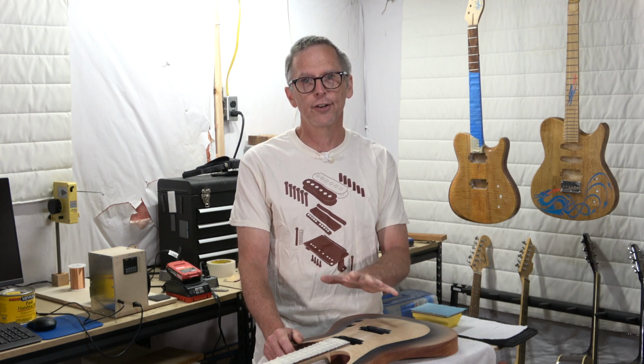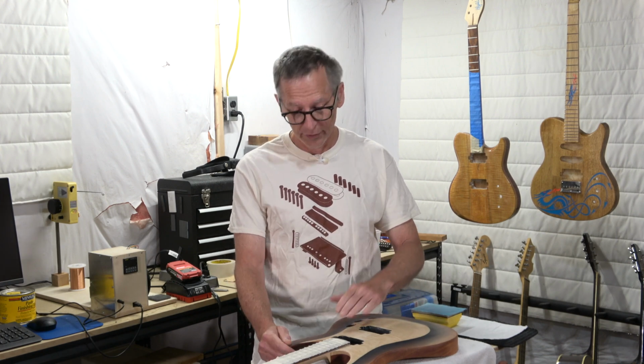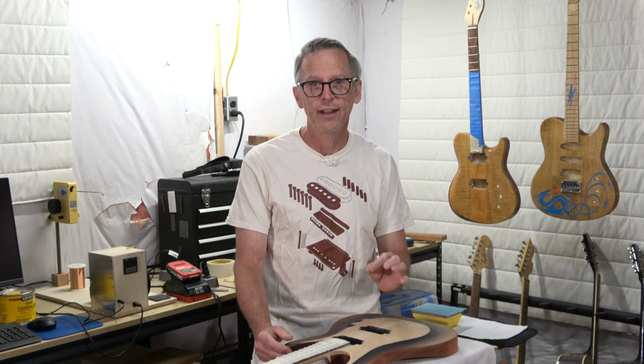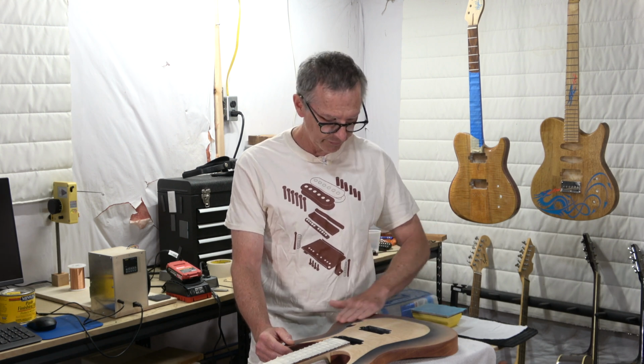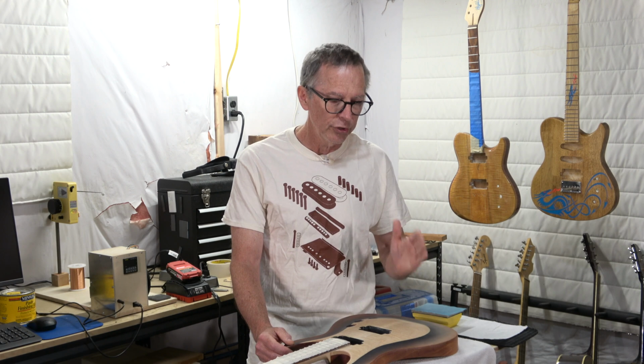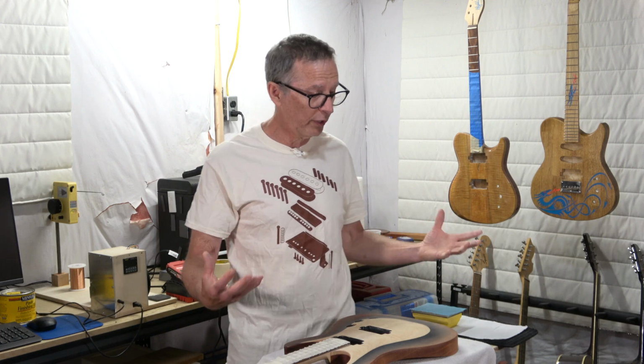And you'll know that's true after you've sprayed your clear coat, let it dry, and then run your fingers over the surface. You can feel a subtle texture. You might even feel some little dust nibs and lint spots that have settled onto the surface. So you need to get rid of those to get that perfectly smooth finish, even though you're only hoping to achieve a matte sheen. So I approach it pretty much the same way as I level sand a clear coat that I'm going to buff out to a high gloss shine.